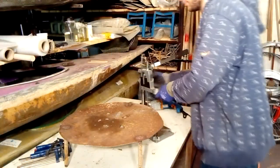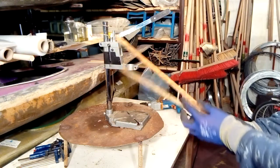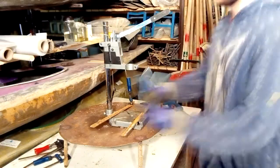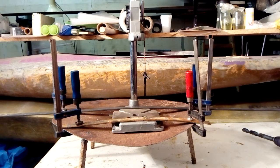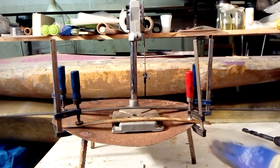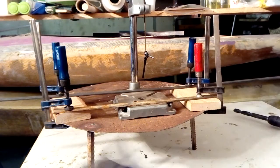Let's try it out. I'll use these rusty pieces of mild steel for clamping. They are not long enough. I tied it down so much that it bends the piece that I'm drilling, so I'm just gonna add some shims underneath — and that's much better. Almost no bending. So let's try it.